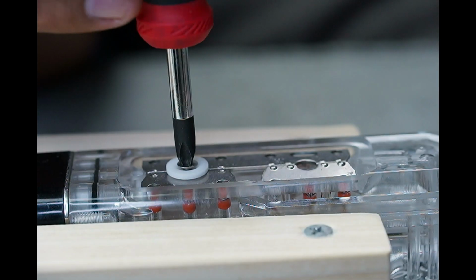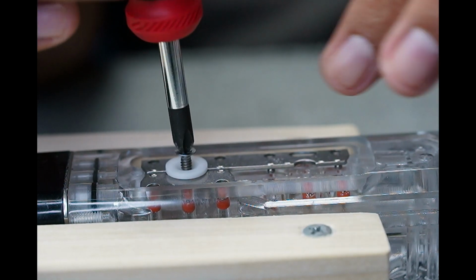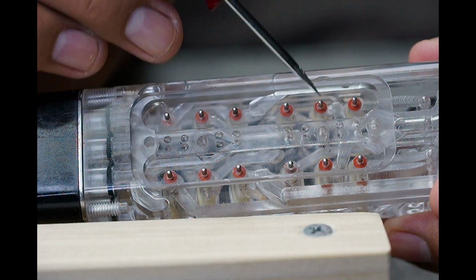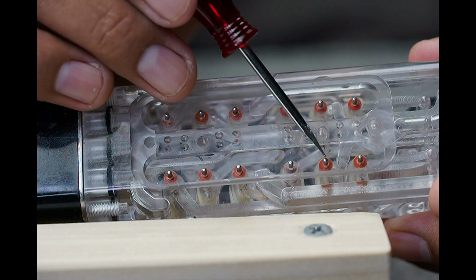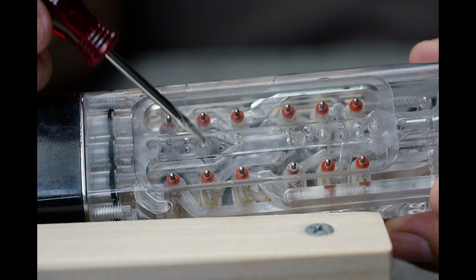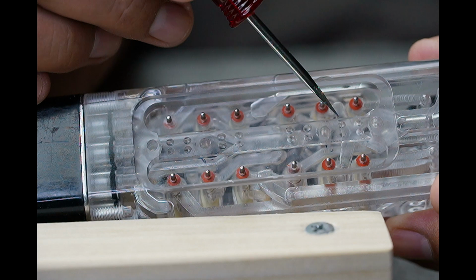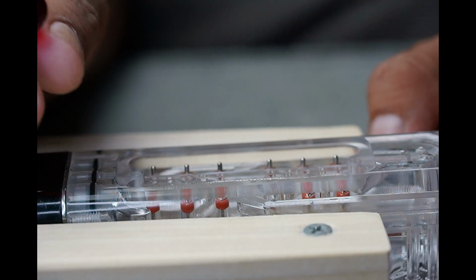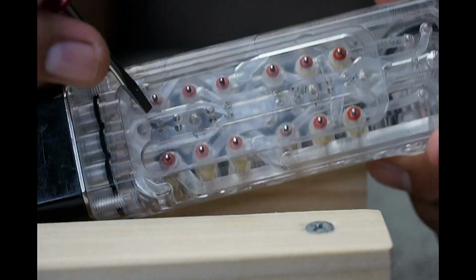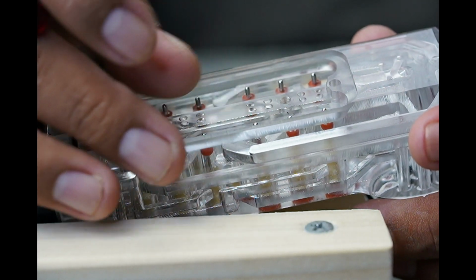When we take the plates off, it's just held by a countersunk stainless steel Phillips screw. So the top two from the nozzle, these two stems, plungers, are carbonated waters. These two here, the one closest to the heel, these are non-carbonated drinks. These activate the non-carbonated side. These activate the carbonated side. What is common out in the field is the failure of these O-rings up here, and we'll have water or syrup coming out from underneath the plate, the top plate, the button plate.